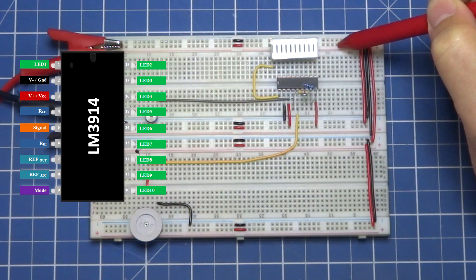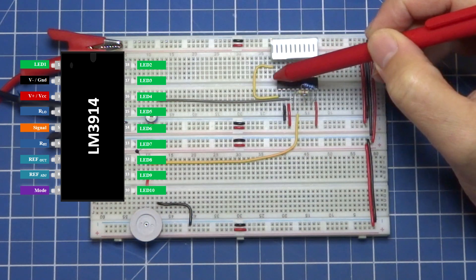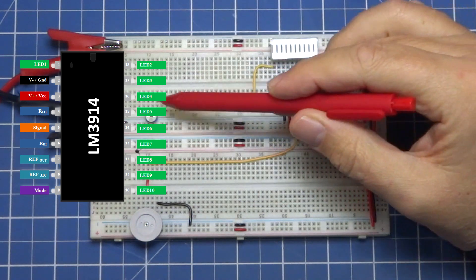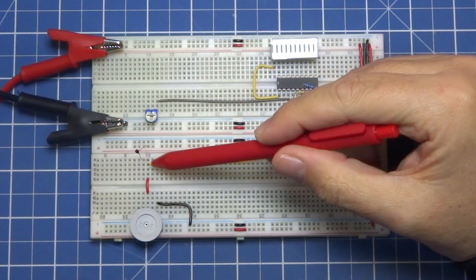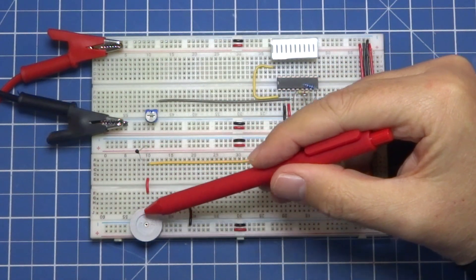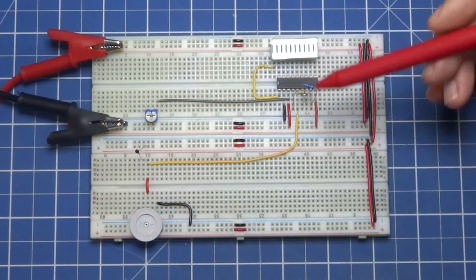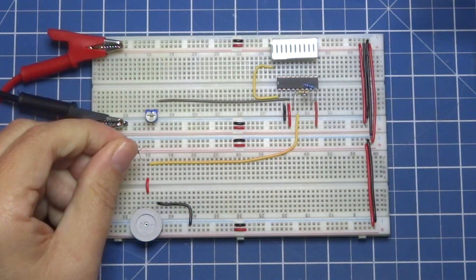I will turn on the source — 12V — and activate the output. I activate the output and nothing happens. Each side here is like a single LED. I turn on the positive side on the red line, which is the direct input. The negative I turn on the signal pins, except for pin 1 which reverses. In the red I have the reference, and I have the voltage divider between the NTC and my trimpot, which is connected to the negative. I feed the voltage divider into pin 5. Nothing is happening on the circuit — I will try to heat it by putting it on my hand.